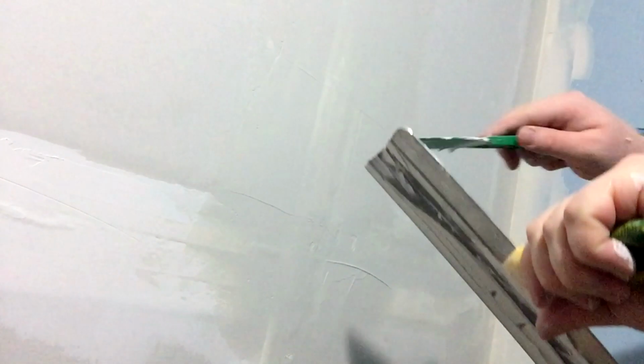You can always do a third coat, which is actually needed, or a fourth coat, which can just help hide your mistakes. Like maybe you could see this one here. You can see I've got a bit of a wrinkle here, right? This is not necessarily a major problem. I take a little bit of mud, it doesn't need to be much, and I start smearing it over.